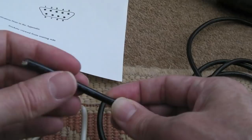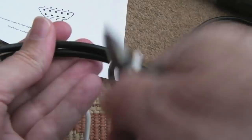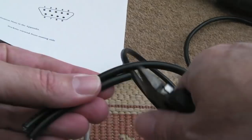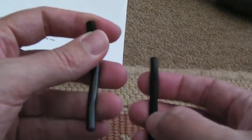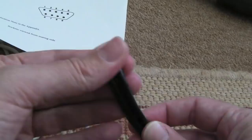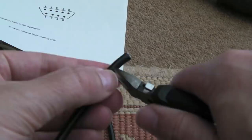This is going to be a bit of a bodge but it'll look tidy. I've ordered some 9-core shielded cable so I could redo it properly later. I'll strip back one piece of 6-core cable, pull out 3 wires from a second piece, and encapsulate the whole lot with heat shrink to give 9 wires total. I've got blue, black, red, white, yellow, and green for the colours. I'm going with a colour standard: yellow for H-pulse, yellow-outer for HQ-pulse, green for V-pulse, green-outer for VQ-pulse - so worst case I can just swap pairs around if I've got them the wrong way.